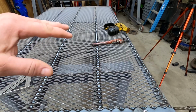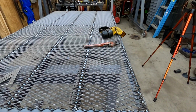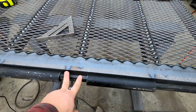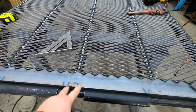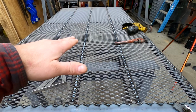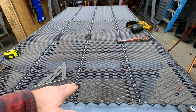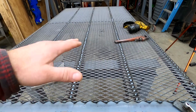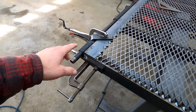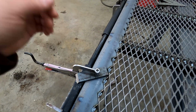Since this gate is a little longer, there is a little bit more weight further out, but since the gate's skinnier, we cut off a lot of weight on both sides. So we'll have to see how it works out. I put this little gap in here. Worst case scenario, we can put a 5th spring in, but the only problem is last time we put extra springs in his old gate, the gate stood above the ground and you had to step on it to get it down. Once the springs wore out, it would sit on the ground fine, but it's just the few days of having to keep pushing it down. But anyway, let's get this thing ground so we can get these welded on. And then when the truck gets here, I'm going to cut the old ones off and, oh shit.